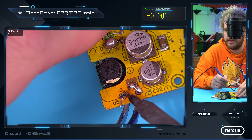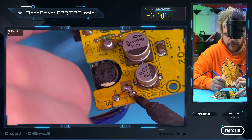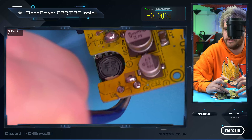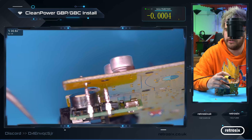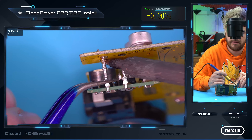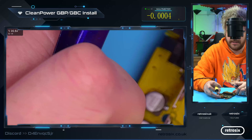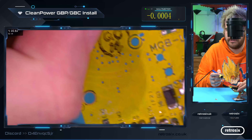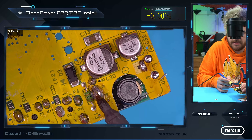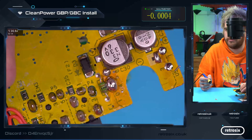It's all about keeping these two pads heated at the same time — if one is still firm, the other one won't come out. Now you can see it's come loose. We have it out of these holes. Just go from here and blob solder — now we have that side out. The other side's easier: you can just hold it in the air, warm up these three pads at the same time by putting your iron in a line, and the board just drops out.